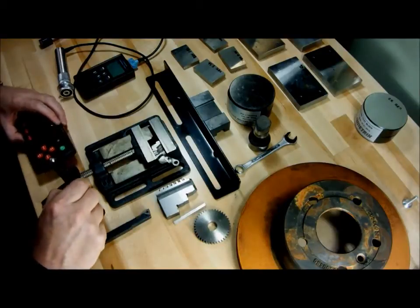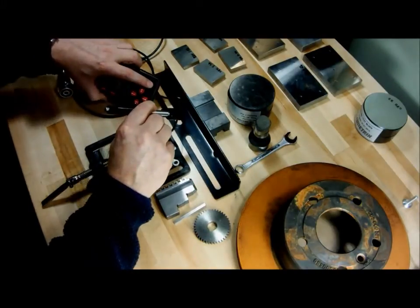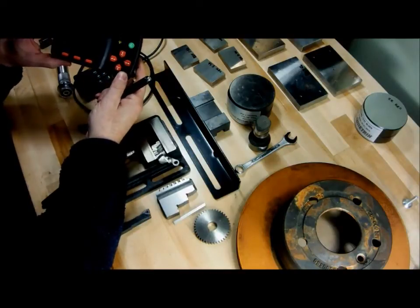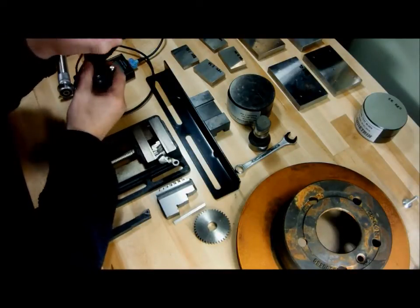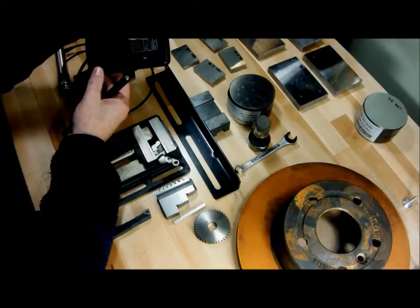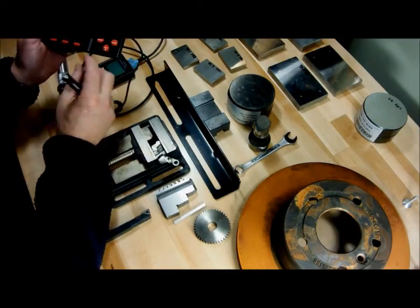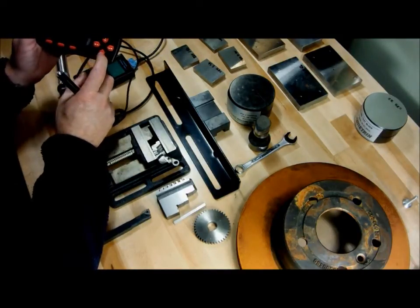The way this is held is when the handle is pushed in, little grippers grab the top of the slug and hold it inside the device. Then we can take it to the material being tested after powering on of course. We choose a material type — in this case 01. If we look on the back of the tester it'll tell us the material types: steel, cast steel, tool steel, ductile, and so on. Then we can set the scale that we want to measure in.